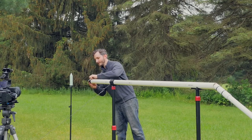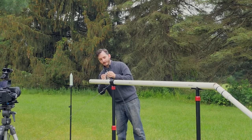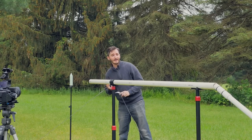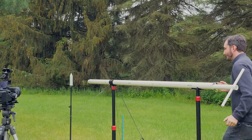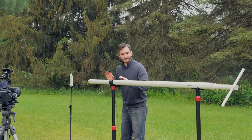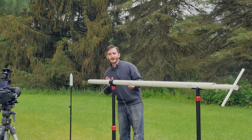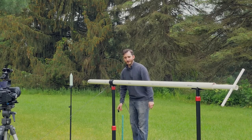To reload, pull off the tape and the old burst disc, reuse a bit of tape to hold the next projectile on, and reload the piston — it just pops back into the end of the pipe. One downside to this design is it needs to be held firmly in place, since you're pulling against 45 pounds of pressure. I have stakes in the ground with wire and rope to keep the cannon sturdy, and the pipe supported by stands and outrigger wires so I can pull on it without it moving.